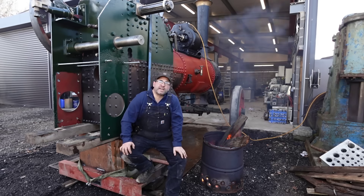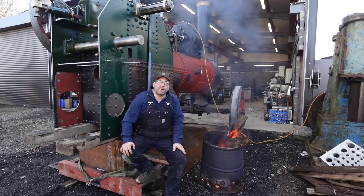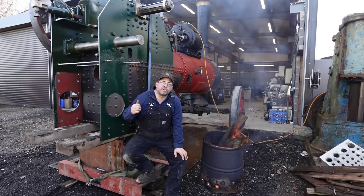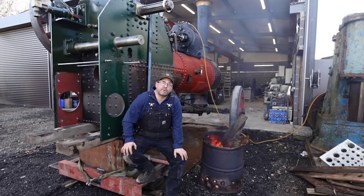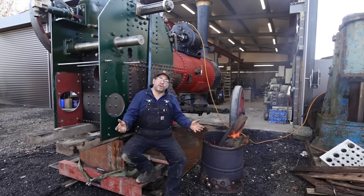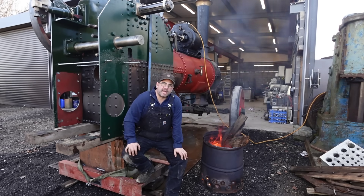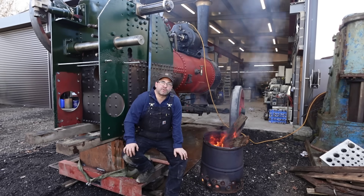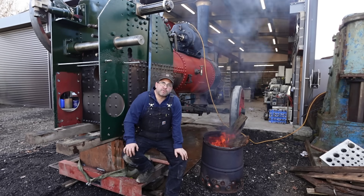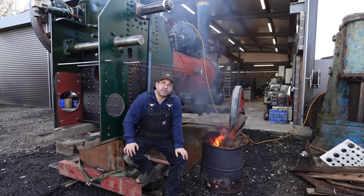At the minute I've got the hose in the top — the hose is filling the engine and we're going to get it filled right up with water. I've got the fire going, just get that hot and burning down. And as soon as the water's topped up to the brim, we get that under the firebox, under the engine. We'll gently warm the water up, which should in turn warm all the steel, expand the steel, and it will be as it would be when we're running it. So we're not going to be stressing the boiler — it should be a bit more friendly on it, should we say.